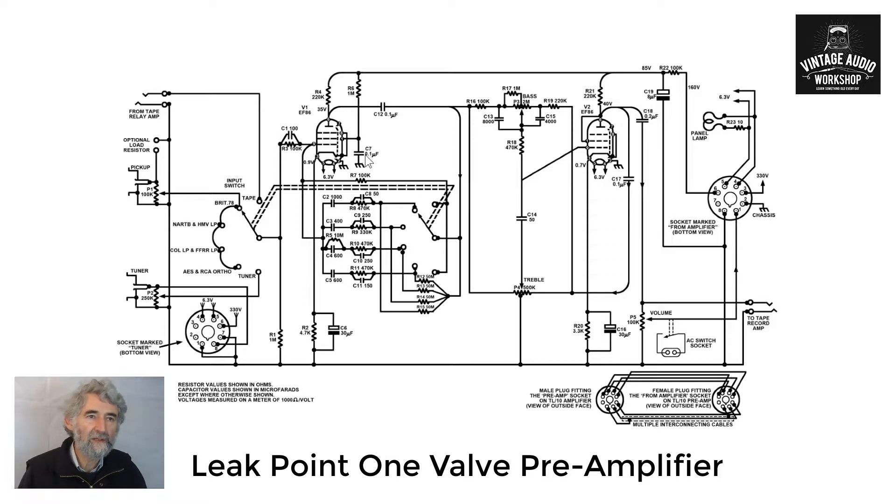Quite a big decoupling capacitor considering the value of the series resistor. We then move on through the capacitor — that's the feedback to the switch. We then go into the Baxandall, which I've explained separately elsewhere — Baxandall active bass and treble control. With the Baxandall, as is typical, you need a special pot with an earth tap on it partway along.